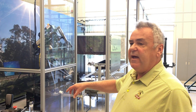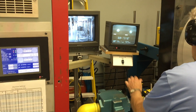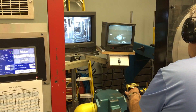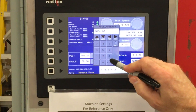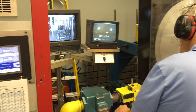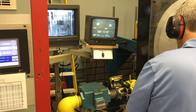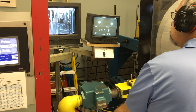Once we've determined that for a dozen golf balls, we take that same dozen and test it at the ITR — the Indoor Test Range. We test it at 15 different speeds and spins. The speed that it comes right off the club head in this particular instance is going to be about 185 miles per hour, with the club head swinging at 120 miles per hour, a backspin of 2,500 RPM, and a launch angle of 10 degrees. Then we test it with conditions all the way from where it takes off from the club, all the way to where it lands.